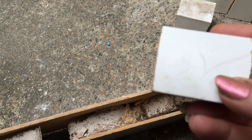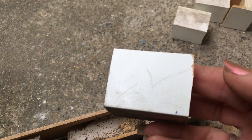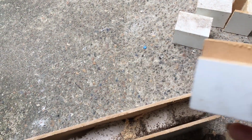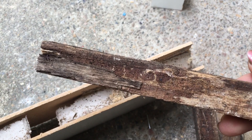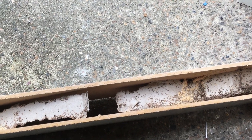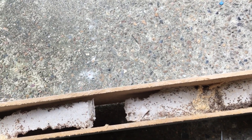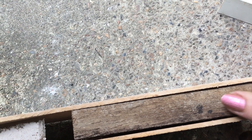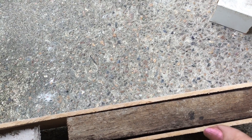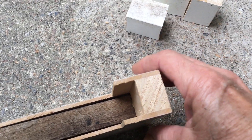I've taken some of the off-cuts from the bottom of the doors, which I've just cut into 5cm pieces to use for the feet. You're going to need some spare pieces of wood that are just 2.5cm wide, because at the bottom of your panels from the doors you can't attach your foot directly. So I'm taking a piece of wood, gluing it in, nailing it in there, and then screwing the foot on.